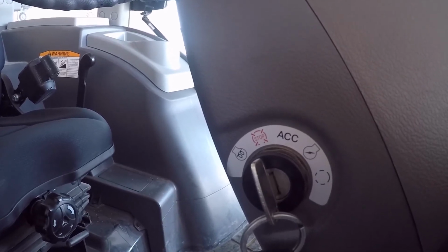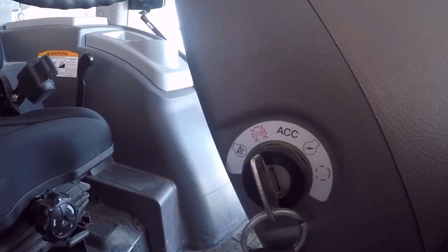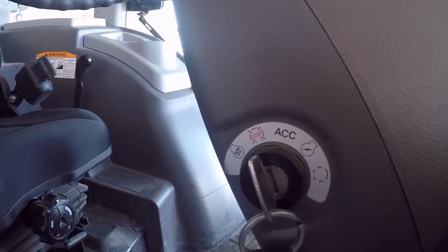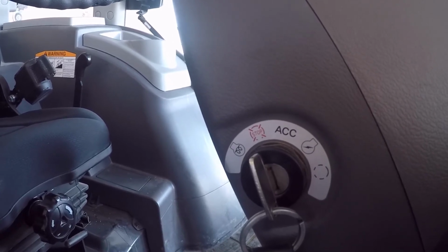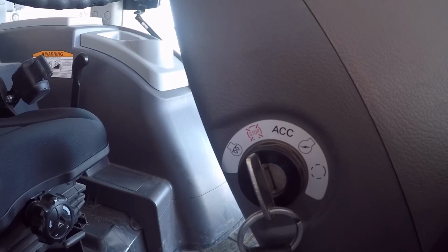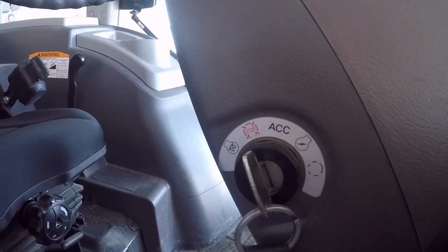Now if I understand the system here properly, it only will cycle at the max for 15 seconds. Now depending on what the water temperature is in the block, it could be less than that by quite a bit. If I read it right, above 140 degrees Fahrenheit on the block water temp, the glow plugs don't come on at all. So if you're just below that, the glow plugs might only come on for a second. But it's all predetermined and varies on the engine water temperature.